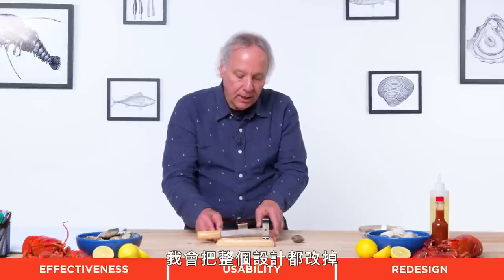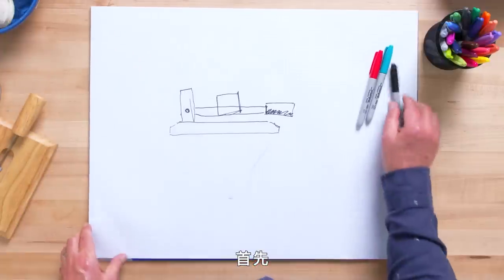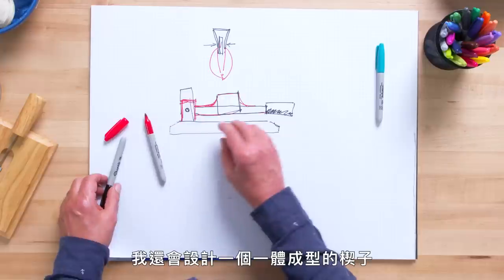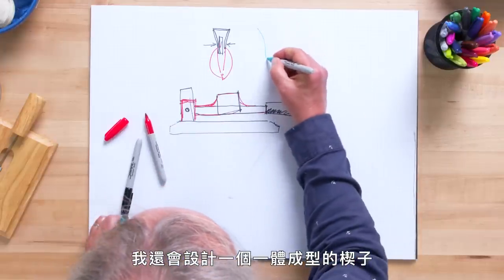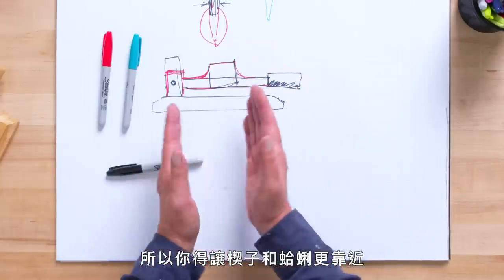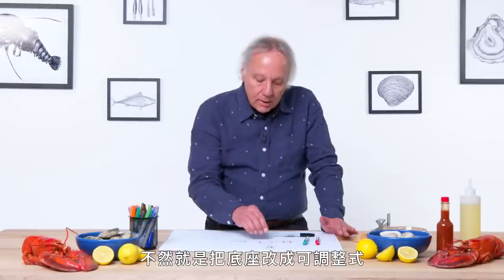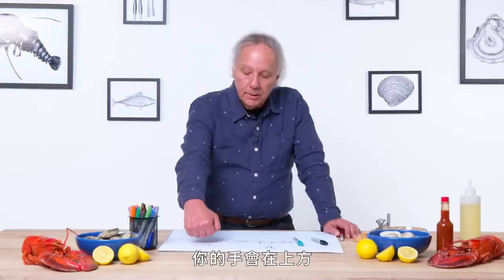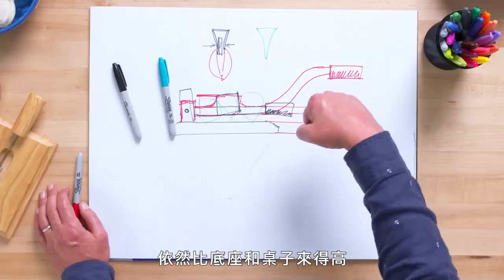This really needs to be more graceful — I would totally change the way this is designed. First, I would make this part more stable and take the wobble out. I would come up with a wedge shape that is simply one continuous piece, kind of like an axe. Smaller clams don't take advantage of the wedge, so either change the wedge shape or make the base adjustable to raise the clam. I would also raise the handle higher so your hand stays elevated above the base in its fully closed position — that provides more leverage and prevents your hand from smashing against the base. Happy knuckles will make you happy as a clam.